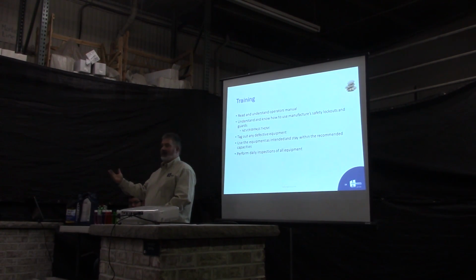We have a little more problem here because we use solid tires in all our equipment, so they take a little more abuse. But it's important that you check to make sure that all those lug nuts are tight almost every day. It can be good for 3 weeks. Week number 4, tire falls. So just always make that part of your inspection.